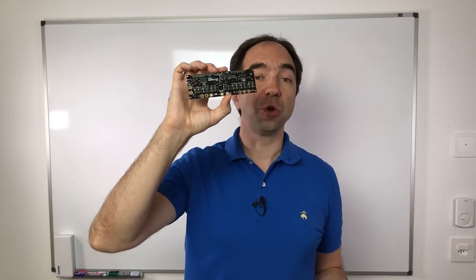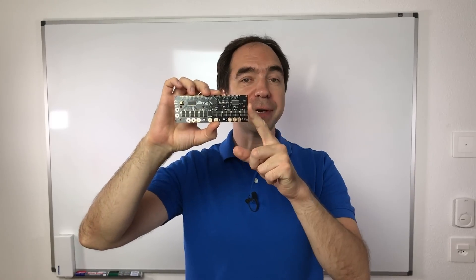But there are some drawbacks. For me the main drawback is that you need to solder a lot of wires. This controller can drive two motors, so you have three wires from each motor, around five wires from each encoder, you also need serial communication, power, and a braking resistor. In total you have something like 20 wires.